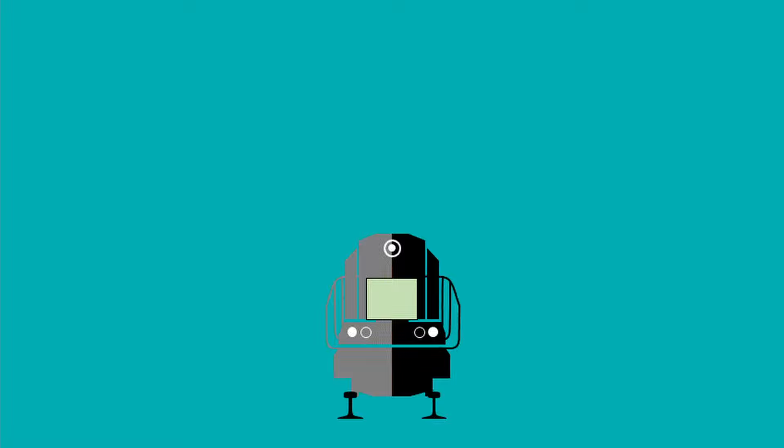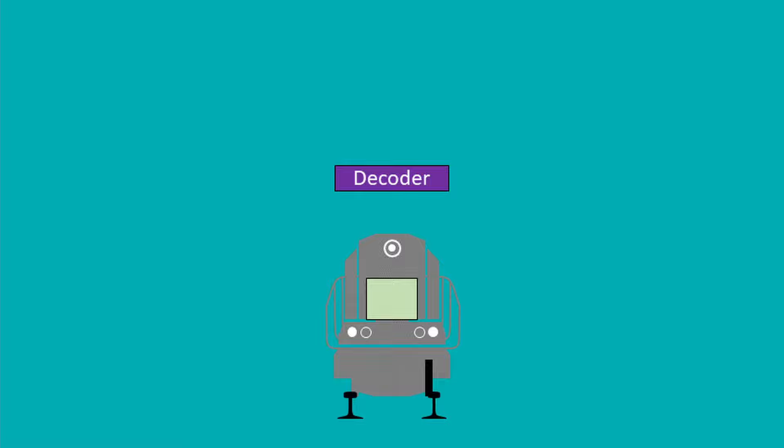Now on to isolating the motor. What does it mean to isolate the motor? Let's look at the schematic of a locomotive. On one side we have the power pickups that connect to the plus side of the rail, and one side of the motor, and one side of the lights. On the other side of the locomotive everything is connected to the minus side of the rail. So if you increase the power voltage on your track, then because everything is connected with each other, the motor will automatically run faster and the light will shine brighter. But with DCC, we do not want that.